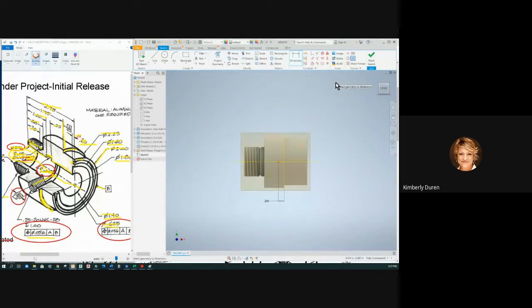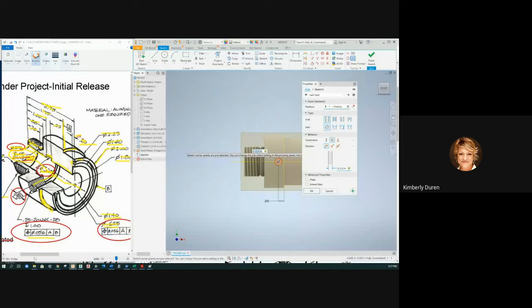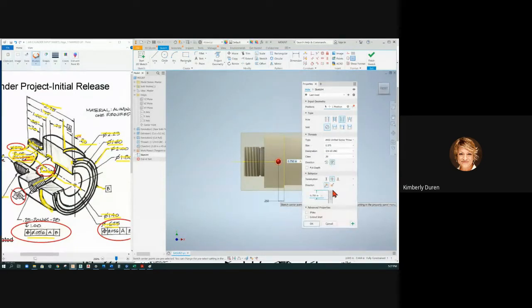Now I can type H for hole, and this is going to be a 1/4-20 UNC 2B with a depth of 1. So I'm going to go to a threaded hole, and it has a depth. Now right away I see 2 depths here, and that is not correct. I've got 1 depth on my callout. So do you see this button, full depth of thread? This is how far we're going to tap it down. We're going to use a bottom tap on this that would come from the bottom out.